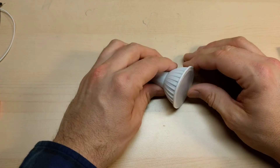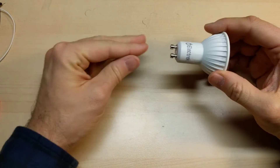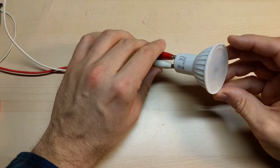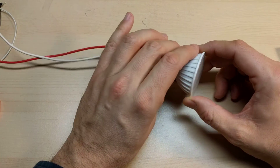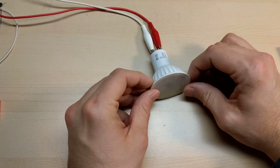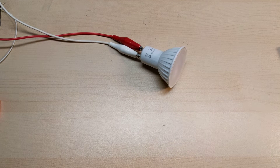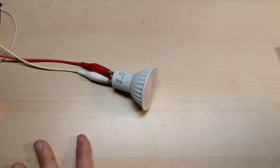But I was always curious what happens if you try to run one of these on 120 volts. So I'm in the US and unfortunately I don't have a handy socket here, so I've rigged one of these up. Do not try this at home — this is not particularly safe — but there we go. I have two clip leads hooked up. It's not live right now; this is disconnected and I'm going to plug this in and we're going to see what happens. Possibly nothing. I'm kind of betting that nothing's going to happen. The capacitive dropper will have the voltage too low to drive the circuit board with the chips on it, and pretty much nothing's going to happen.